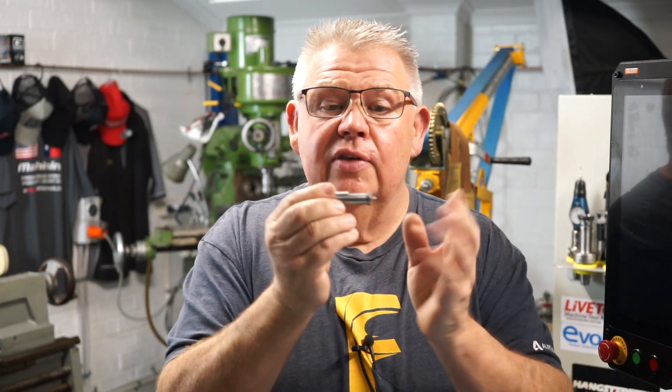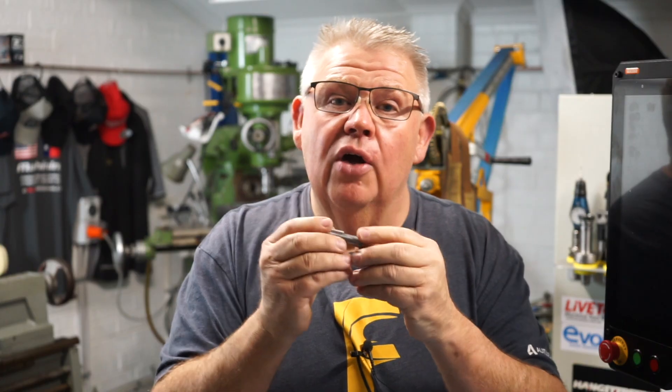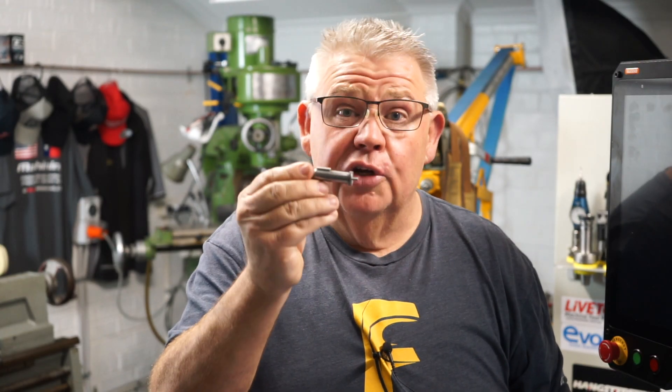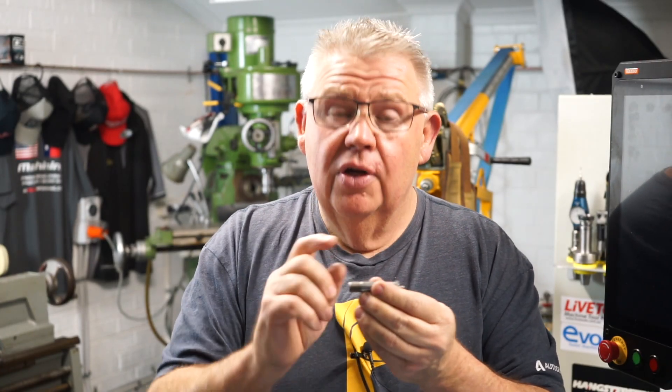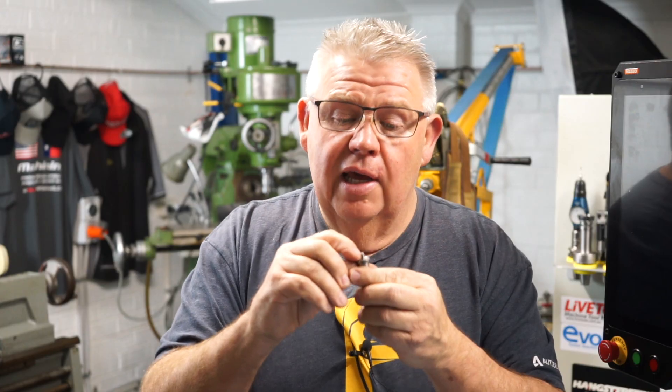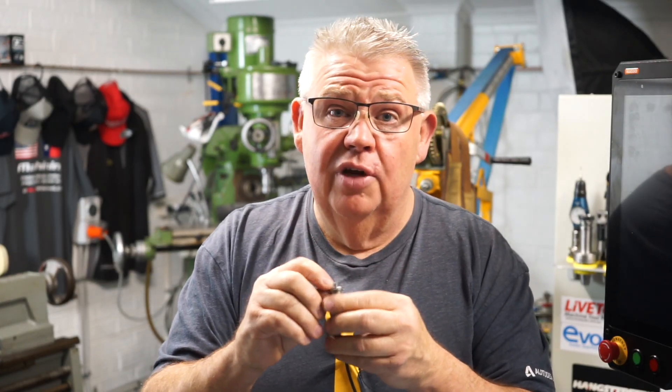The problem is the spindle motor on this machine is belt driven, and then there's an internal belt further along the shaft down to a little sub-assembly, and that sub-assembly is where the encoder needs to go. The shaft on this one was not suitable — it was inside a cartridge that was recessed in, so there was no way I could put an encoder on the end of the original shaft. Also, it's actually a 12mm shaft with an M12 by 1.75 thread, and this little tiny teat on the end here is only 3mm.